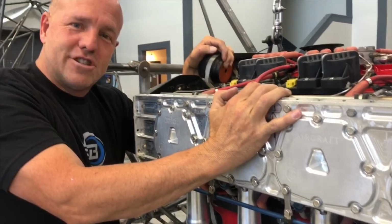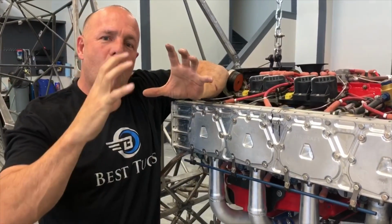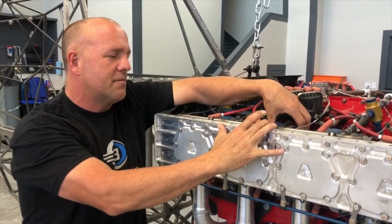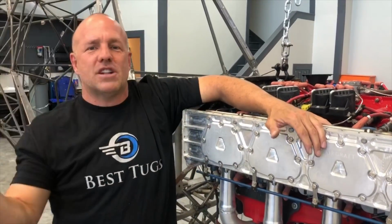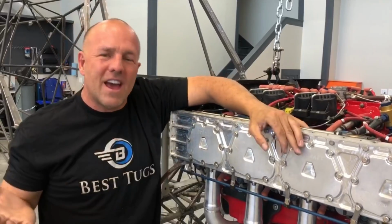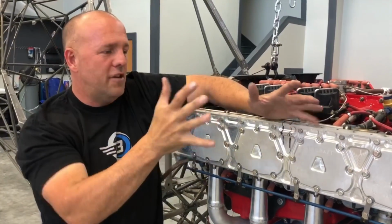Because it used to be supercharged and I had it really pumped up with a lot of horsepower, when you push engines way beyond their original design limit, the cylinders can start to walk a little bit, and all the stress is back at the case. If you put a camera on slow motion, which I tried a couple years ago when I did this, you can actually see those cylinders move. That's normal, but when you push them over the top, you can start cracking the case and creating problems. So this was a way to lock all the cylinders together, so it's more like a conventional engine today. They no longer let cylinders float out in the air like this. They lock them down with a solid aluminum head and valve covers. Everything on it is locked down.